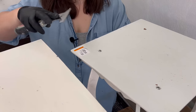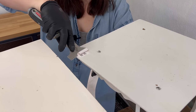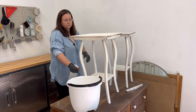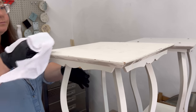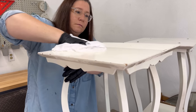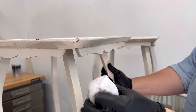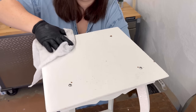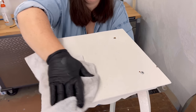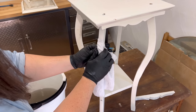I'm hoping I can remove this white paint and fix the construction a little bit to sturdy them up. To get rid of the paint, I could have used a chemical stripping product, but I didn't really feel like dealing with all that goopy mess. Or I could have scraped it off with my carbide scraper, but these are so wobbly and with all of the little pieces it seemed like it would be hard to get good downward pressure. So I decided I'd have a go at just sanding through it. I gave them a wipe down with some TSP and warm water to get some of the grime off first — it's kind of just habit at this point for me to start with a wash.